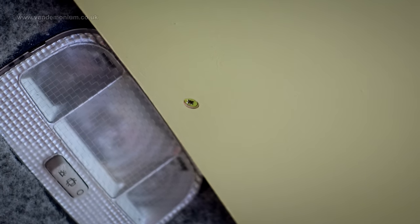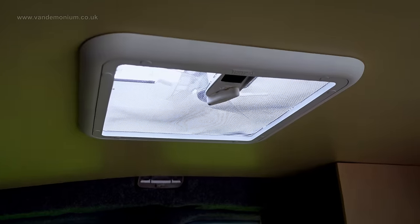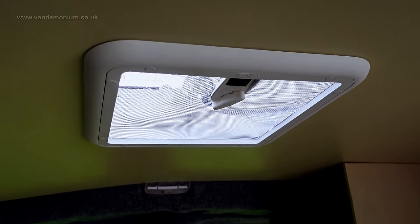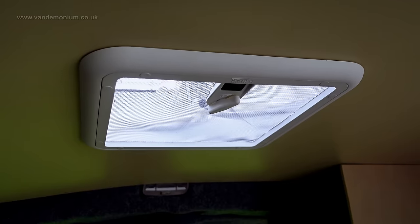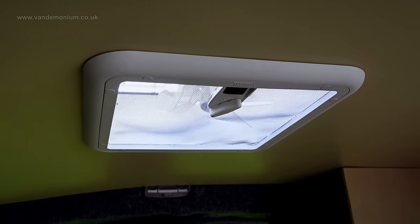The ceiling is only held up with a number of small screws into wooden battens. So taking it down should be, touch wood, straightforward. Unfortunately, it will also require me to remove the base plate of the fan, because that's partially holding the ceiling up. That's just more screws, but it's a bit fiddly.